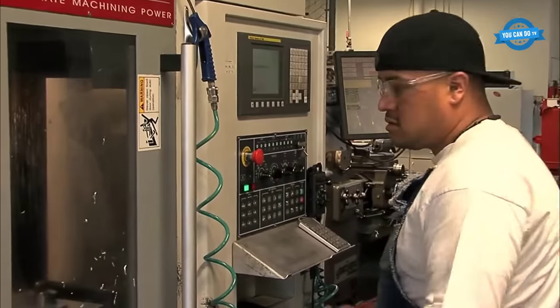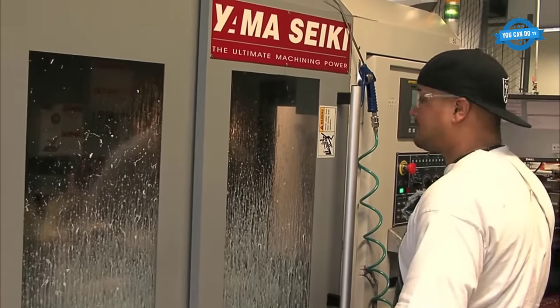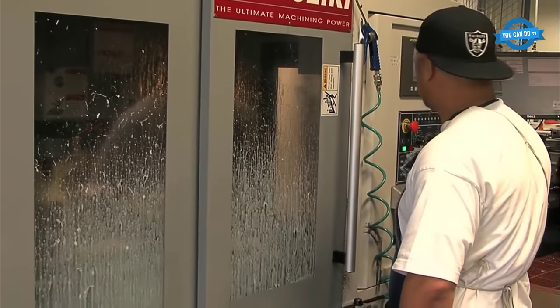The fifth operation is the five-axis dome and profile machine, which is capable of cutting dome profiles, dish profiles, valve reliefs, and vertical gas ports. The machine can turn in five different directions and can handle up to nine pistons at a time, making it highly efficient.